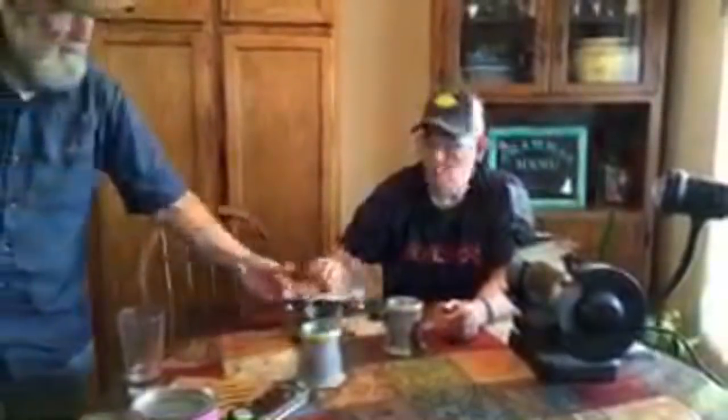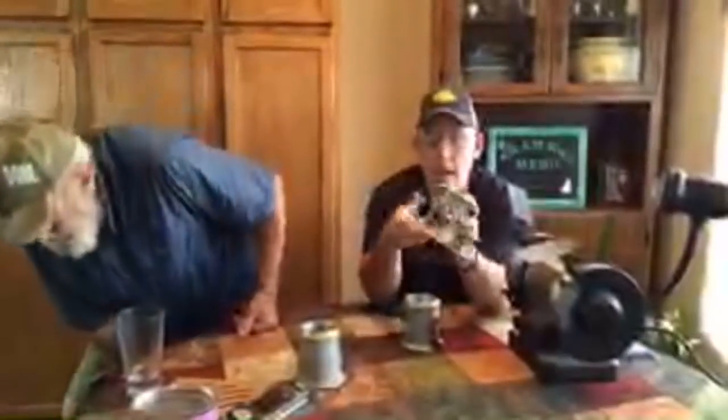You haven't modified the base to work with your plexiglass. You could take our base plate. We got one sitting right over there. You can take our base plate and put it right on here. The point is, the modification is necessary, I believe, because if you don't, all that sawdust is going to shoot right at you, and somebody just talked about that. And it lets more light in from the back side. So it's not absolutely critical that you do. Here's the modified housing with our base plate. So if this was all blocked in, you could absolutely still bolt it up to that. That's no problem. It just doesn't work very well, in my opinion. Yeah, sawdust just comes out in your face.